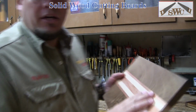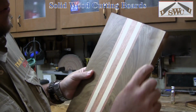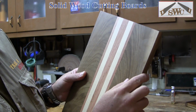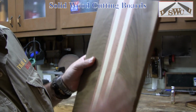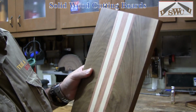When you are cutting a groove against the grain on your router table, one thing to be cautious of is that when your router bit enters the wood or exits the wood on the other side, normally you will have some tear out on the side. So it's a good idea to put a sacrificial strip on the side, so that you have your chipping on the sacrificial strip, and when you're done with all your routing, you remove that strip again.